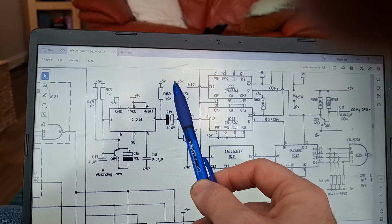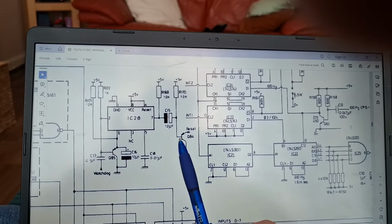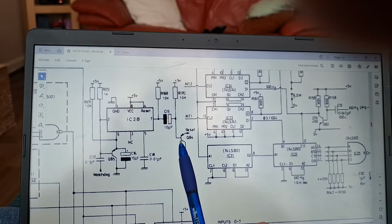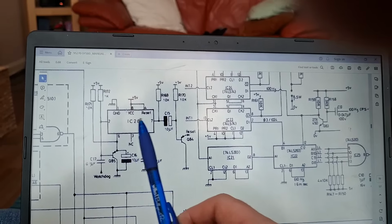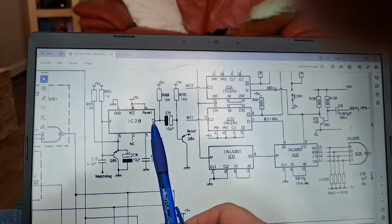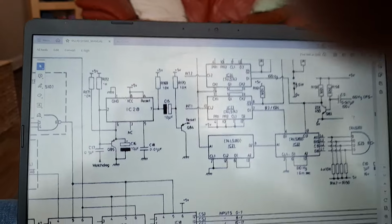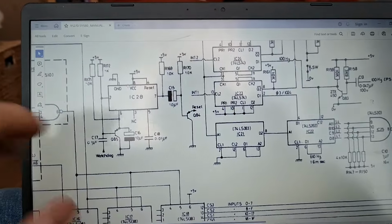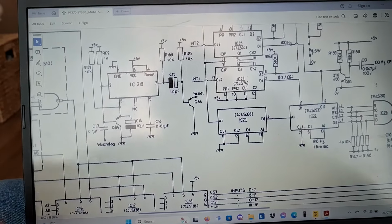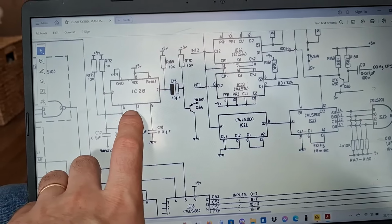So what's high? You discharge that and you send in. You're pulling power away from there for a short space of time through here until this capacitor is discharged. Then this path turns off and you send 5 volts to there instead. It's just a little bit forward thinking. The guy that designed this always thought outside the box, and he's probably determined that it's more efficient to pull current down through here than it is to sink it through here.